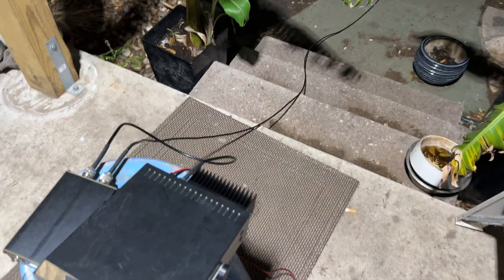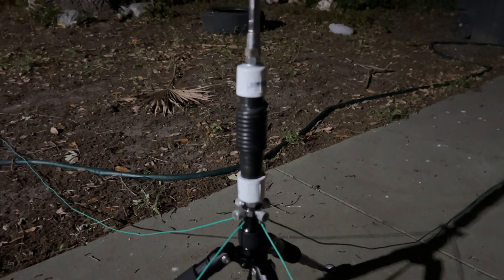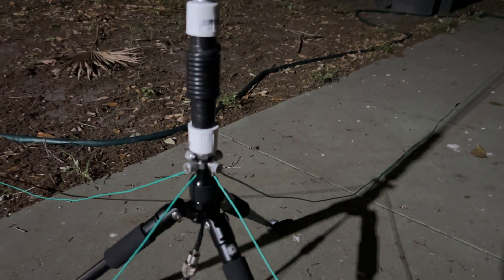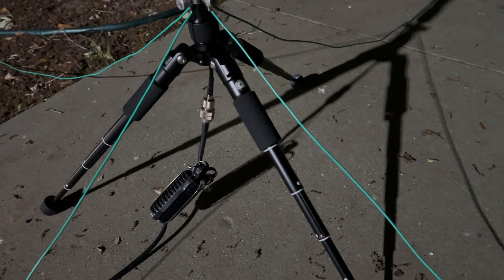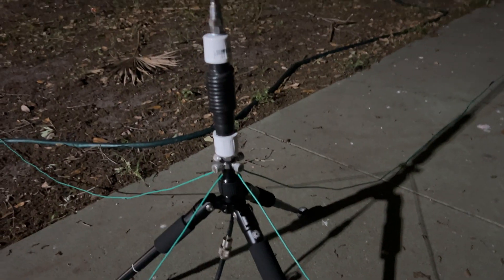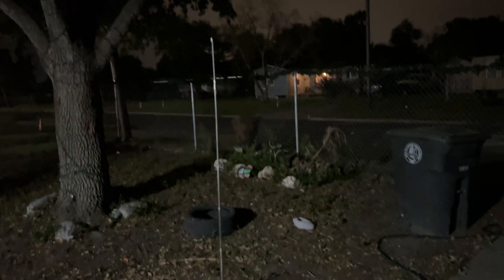Let's show you the new coil. I remade a coil since I couldn't make the RF choke. I did my calculations and I was slightly off on the turns, so we redid the turns and the ground radials. This is the new coil — instead of a two-inch coil, it's a three-quarter inch coil with four radials on the bottom. We have just the regular RF choke right there, and hopefully tomorrow we're going to be testing out my actual choke with a shorter run of coax.